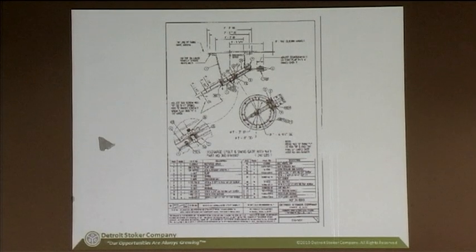You've got ash being sucked out of the silo back in there, and that's what cuts these valves. When these things are misadjusted, you wind up with more cut flaps than you do when they're adjusted correctly, because when it opens, as the ash flows out of there, with less ash, this thing is going to try to start closing against the flow of ash. The ash is flowing out here, out of the front, because this does not open completely out of the line of ash flow.